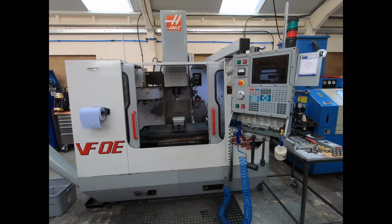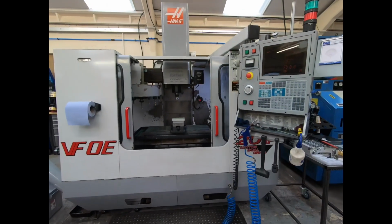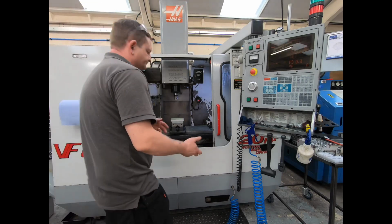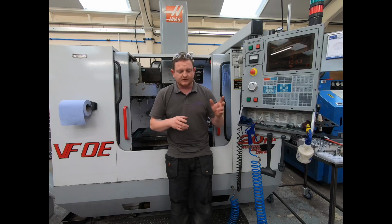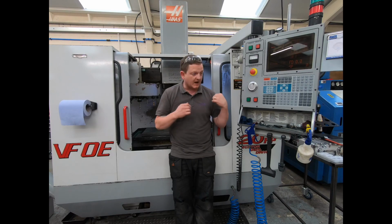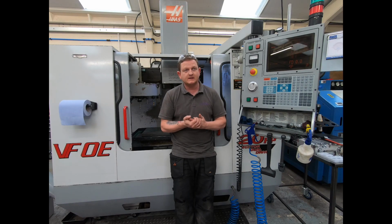You think you just get these things in, plugged in, they're ready to go, but I had to run new wiring. I wasn't quite happy with the power supply that was there, so we changed it and just ran some new armoured cables straight from the mains fuse board with isolated switches and got them completely separate to everything else. So I'm happy with that now, and it's up and running. I've had it for a week and a half roughly plugged in.